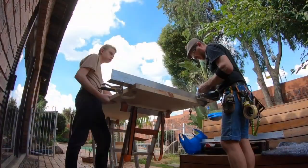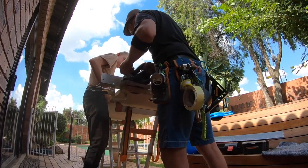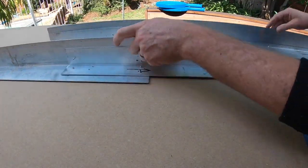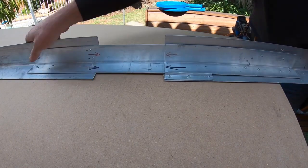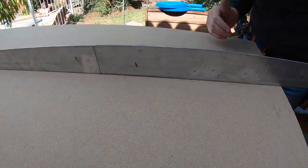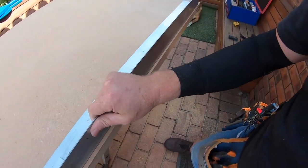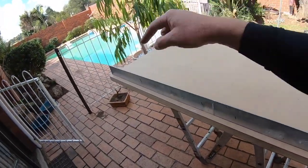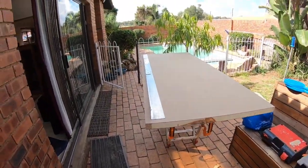We're just going to run the saw along now. I've built this jig to guide the fence, made out of aluminum. It cuts the long edge of the door so one piece just fits into the other, giving us a fence to cut the long side of the door. This door is fortunately almost the right size — we just need to trim off about two or three millimeters. So we're going to fasten it with our clamps and then take our circular saw and run it through to take a few millimeters off.